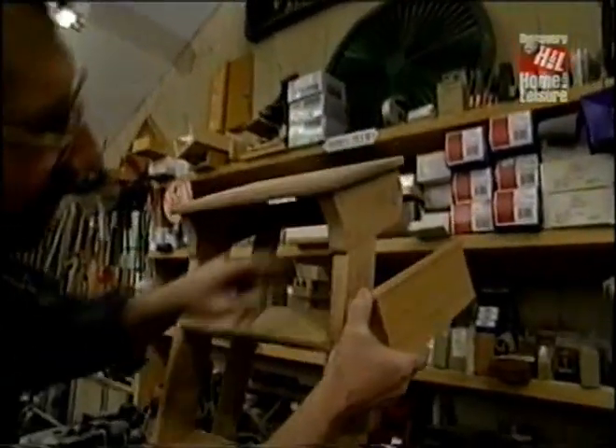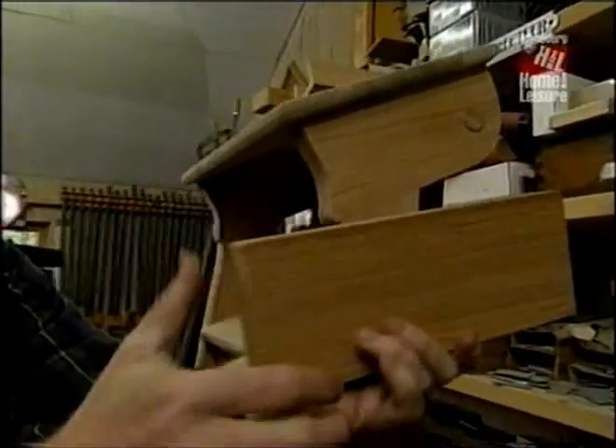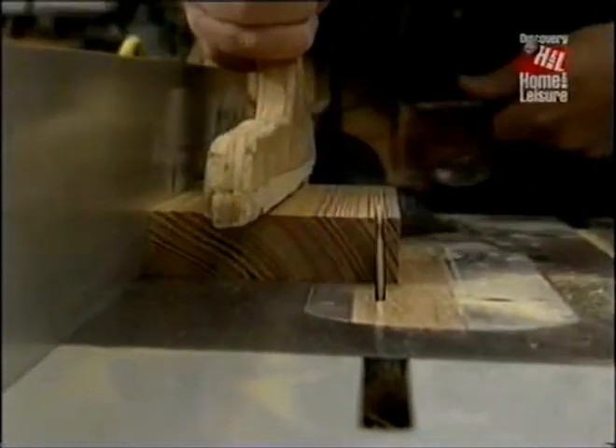Here's a blank for the horizontal piece that gets half-lapped into the rail and also picks up the front of the ladder. The top edge of that needs to be beveled back so that the top shelf will fit properly. To make that bevel cut, I've set up the table saw and tipped the blade to three degrees, and I'll make a rip cut.